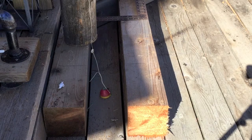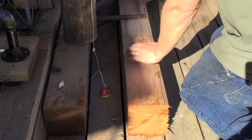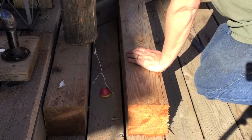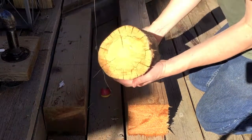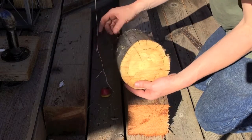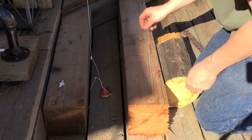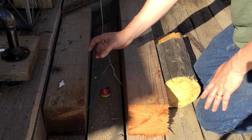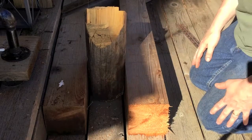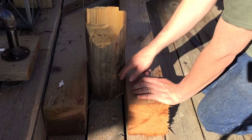The base consists of the six by six - I'll lag them into the support beams. This is the base to the support tower, and this is a little section I cut off so I know it'll fit in there based on the circumference. This is my plumb line so I know where the post is going to go versus up above the tower right there. What I'm going to do is put a pin in that goes through here into it.